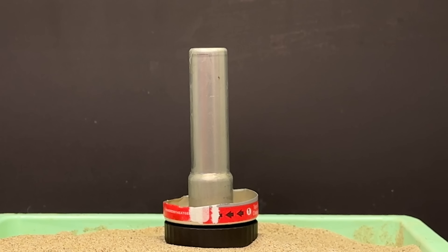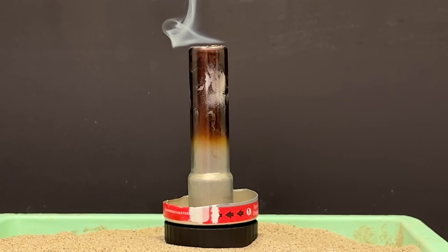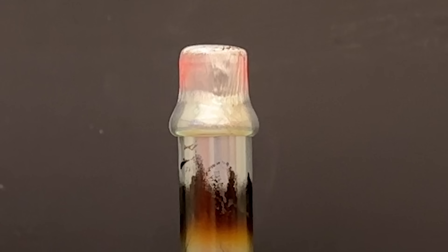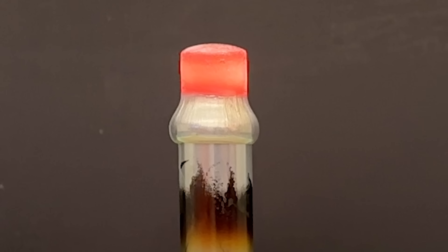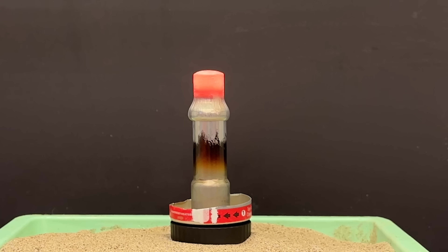It took about 15 seconds until I heard anything, so I'm going to speed up the video to where you can actually see something changing. At first, you just see some steam as the liquid coffee evaporates. Next, the epoxy coating on the aluminum starts to discolor and burn off. Then something really surprising happens — the aluminum at the tip completely melts away. Aluminum has a lower melting point than the steel container holding the thermite, and normally the coffee inside the can absorbs all of that heat being produced, so it never gets this hot. It ended up getting so hot that it glowed red and threw off an occasional spark or two.